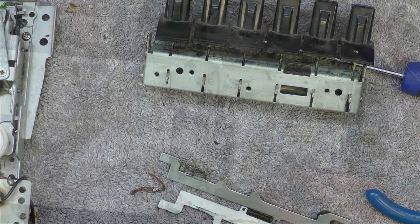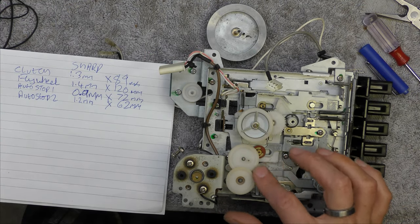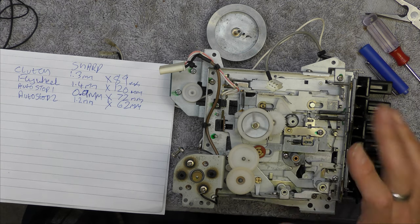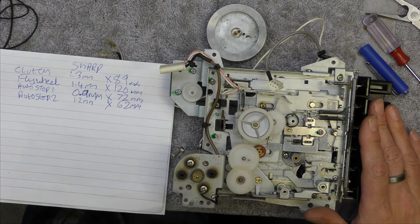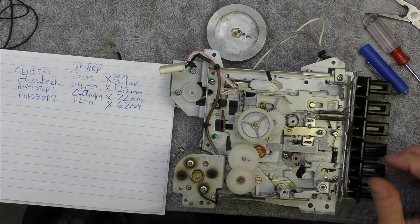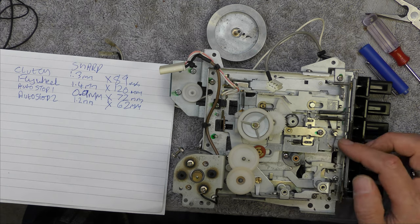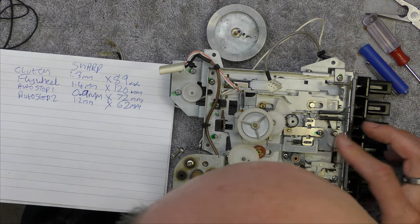Oh, sticky! I don't think I've ever seen such an auto-stop mechanism with so many pulleys. I've got my piano keys back and that's working so much better now. There's a bit of rust which I had to sand off. It's all been re-cleaned and re-greased. I'm going to try and clean up what I can without complete disassembly if I can avoid it.